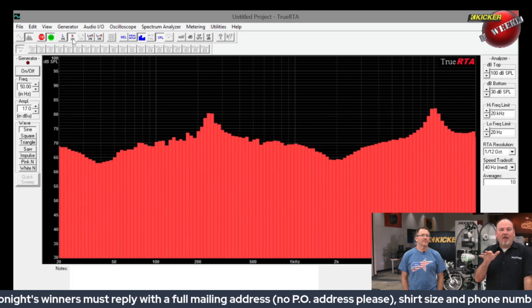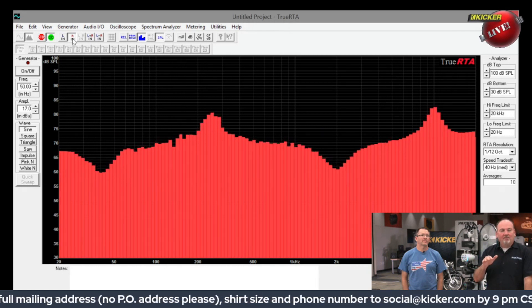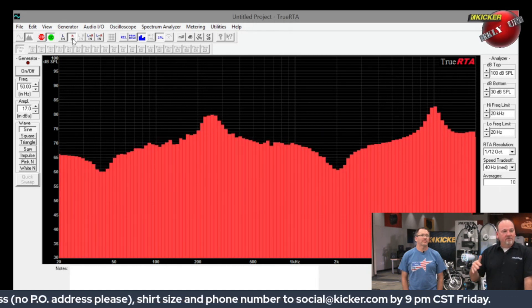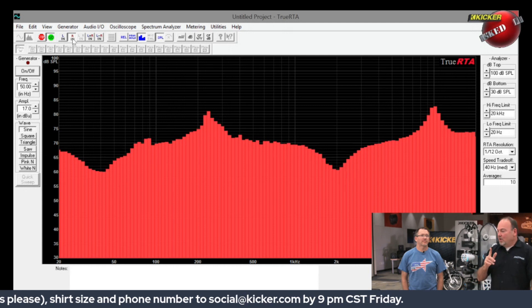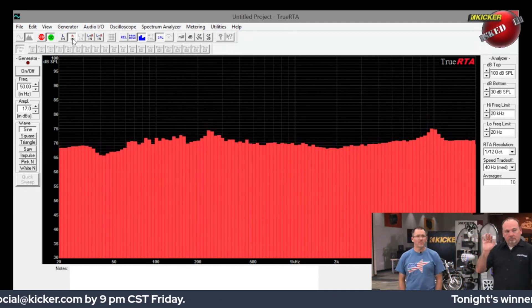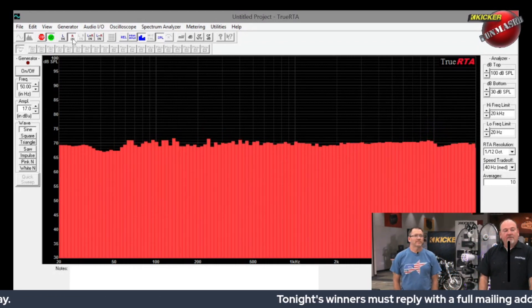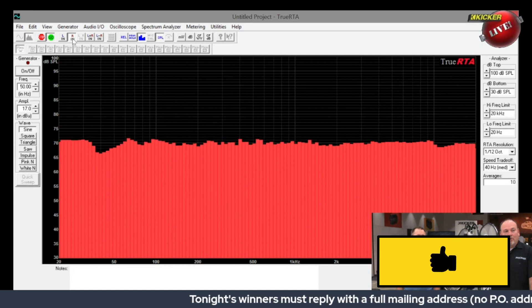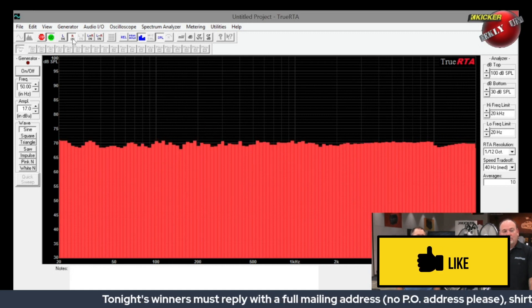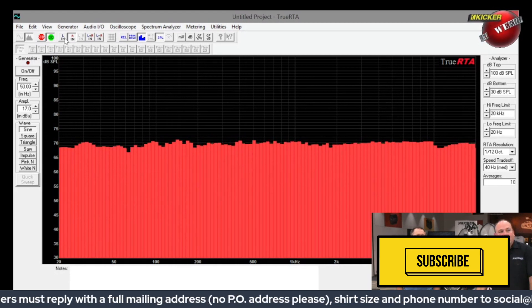I've already run the Key Lock through its setup routine. What you're watching right now is the bypassed signal — the Key is not doing anything, this is the signal just coming into it. Watch what happens if I turn the Key on — just hit the button. And magically, letting it stabilize for a second, you can see that big cut at 40 Hertz is gone, that big boost at 200-250 is gone. We're back to a pink noise flat line on the right channel.